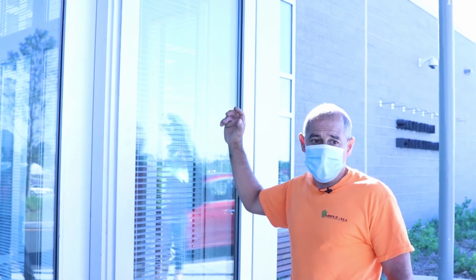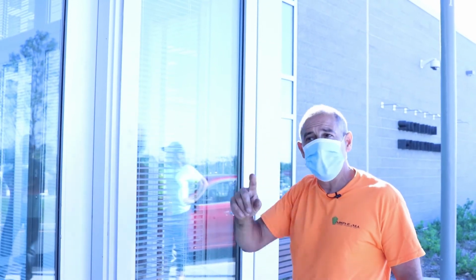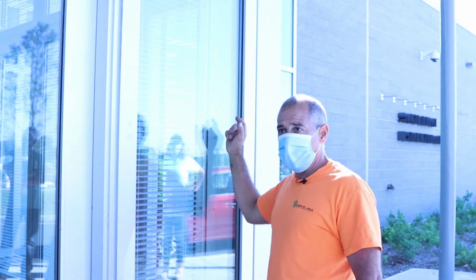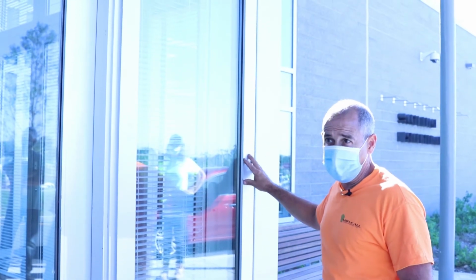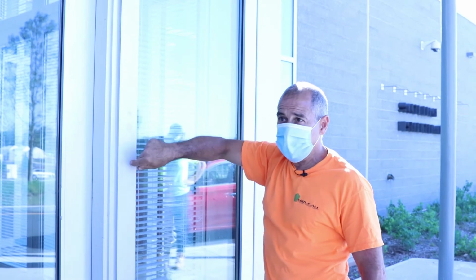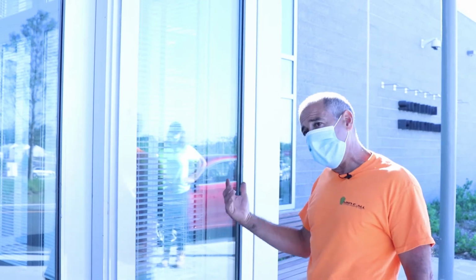Once the unit is in, they give you whatever the lead time is on the caulking to dry. Okay, I'm missing one thing. After the unit is glazed, after it's installed, whether it be spandrel or not, you use temp clips, which are these same extrusions of material, only cut into chunks. Just use a screw and temp all of that in until whatever time the glazing is calling for, whatever glazing you use.